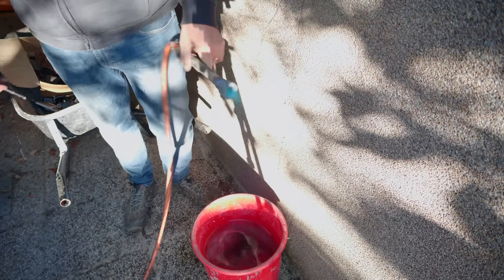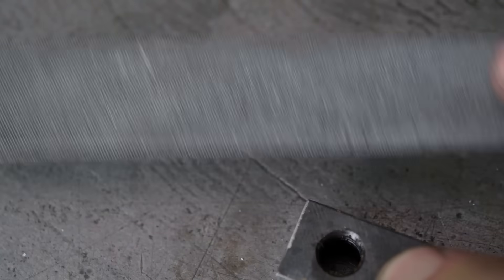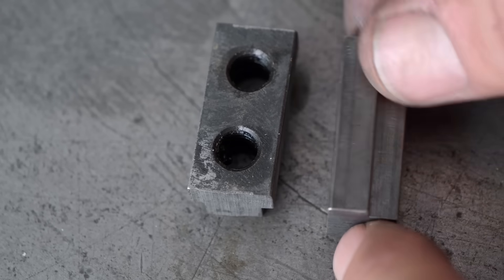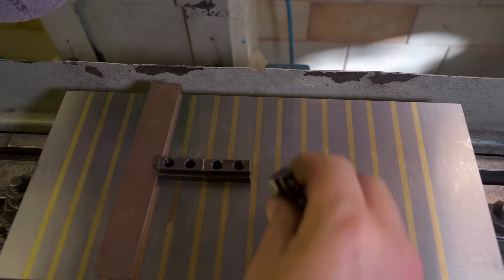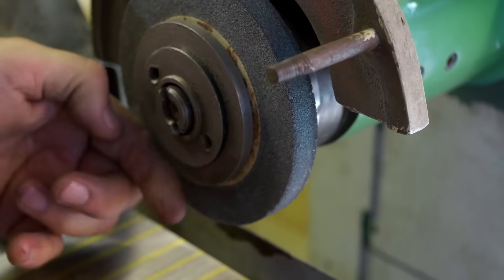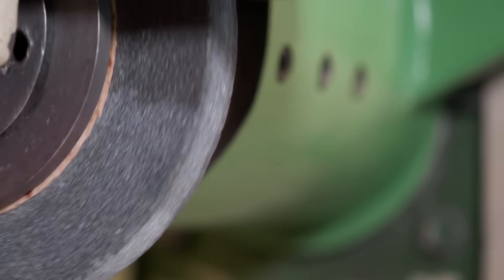The first one's wire burnt through but luckily it fell in the bucket and was hot enough. On the file test the hardness wasn't that consistent — this end was a bit softer, the other end was definitely nice and hard. After hitting it with a wire wheel again, we tempered it back to about a straw colour using the little torch, and then it was time to go over them and make them look pretty with the surface grinder. We weren't that thrilled with the surface finish of the first wheel even after dressing, so we switched over to a different one — which did take a fair bit more dressing to get round, but left a much nicer surface finish.